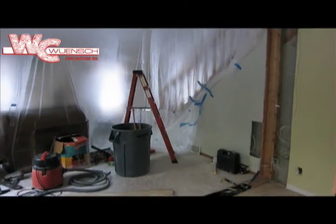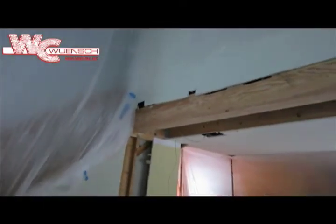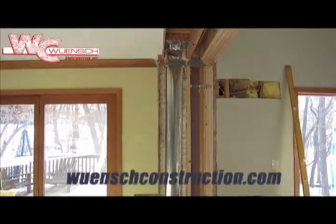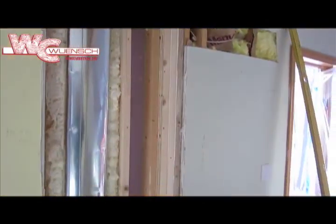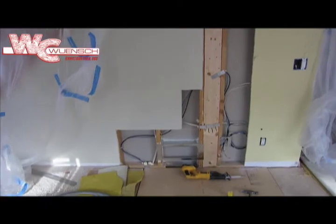We're back again here. We got it all cleaned up. The beam's sitting up here where it's supposed to be. The beam is going over and sitting on the exterior wall — we've got to put in some support posts bearing down to the basement. That's the window, the planter's gone, and the beam is sitting in place. We have the heat ducts rerouted — they're going up into the floor. We have the cold air returns rerouted, going into the wall and up to the second floor. We have all the electrical rerouted.